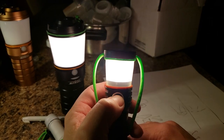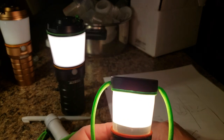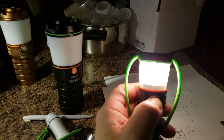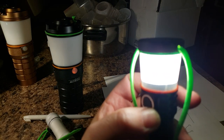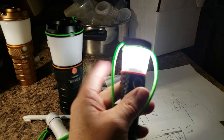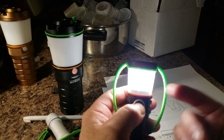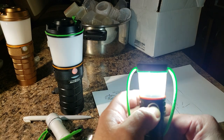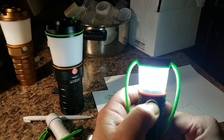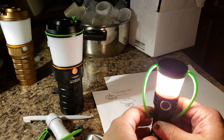Right now this is still using the IF25 factory software — you click twice and it changes the tint. I've already changed the LEDs to 2700K and 5000K 351D high-CRI LEDs. The factory ones came with 3000K and 6500K, which wasn't as great. With the new LEDs you get full 5000K on one end, and all the way down to the full warm side on the other end, with tint ramping in between.